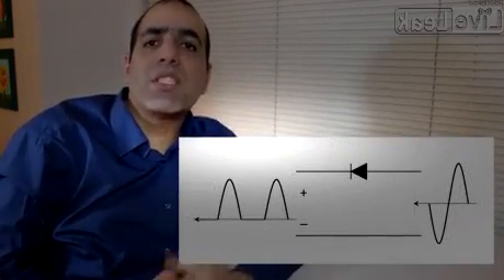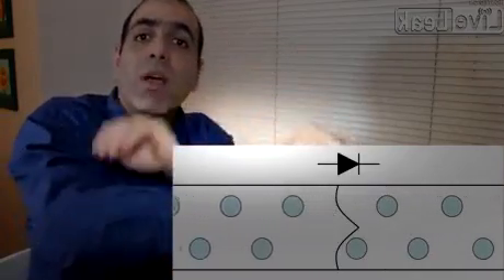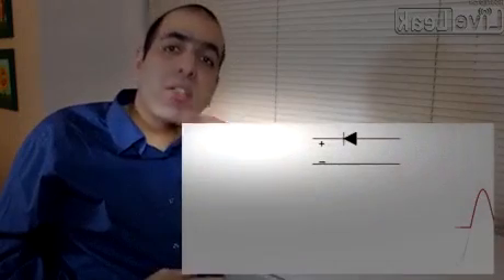The rectification can also be done with a single diode. What's a diode? It's like an electrical check valve that allows current in one direction but blocks it from going back. If you provide an AC voltage to a single diode, it outputs the positive half of the wave.